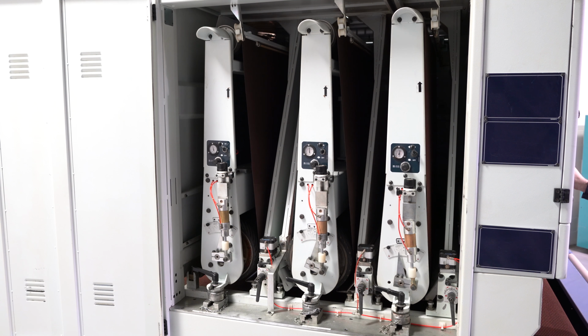Hit the emergency stop. I'm gonna reset it, and I'm gonna start that third head in low speed. That's pretty much it. That's the low speed. Basically, it's a Delta Y soft start, and it's just gonna stick with the Delta and never turn over.